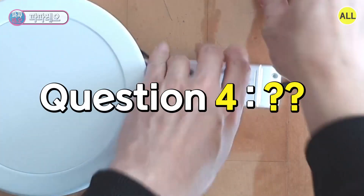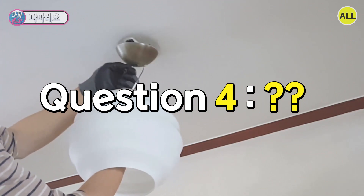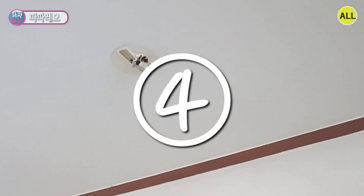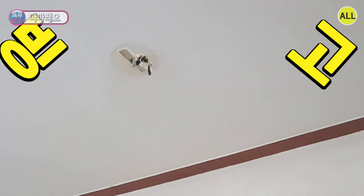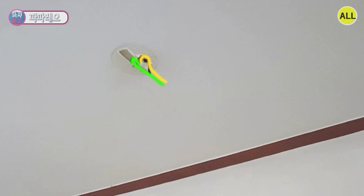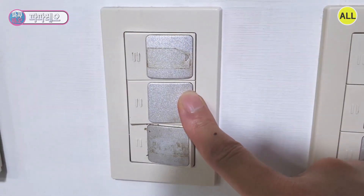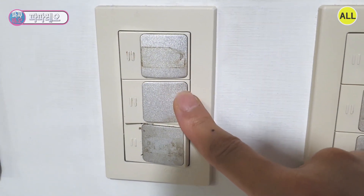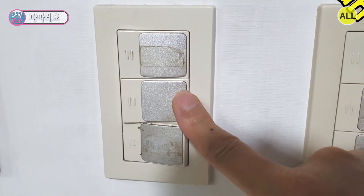How do I connect it for use with a ceiling-mounted light? Just connect the two wires to the output line and the input line. If the lighting is controlled by a wall switch, that switch must always be turned on for the smart switch to work.